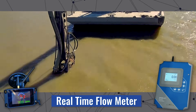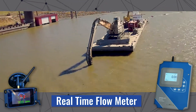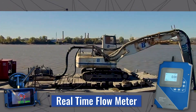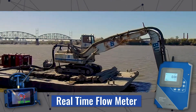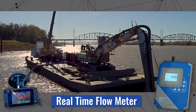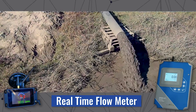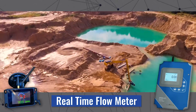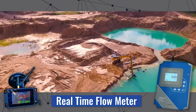It's costly and expensive, and it's just a nightmare. What the flow meter does is help us apply critical line velocities for every material that our customers pump. We can get a pretty good estimate, and sometimes the customer will know what critical line velocity they need. Once you know that critical line velocity, it can immediately be converted to a gallons per minute flow. The operator, now looking at the flow meter, knows any time he goes below that critical flow he runs the risk of plugging the pipeline.